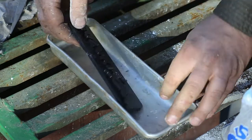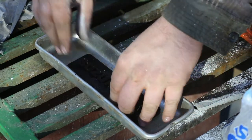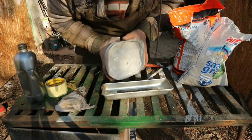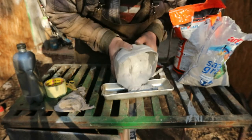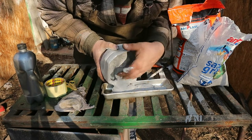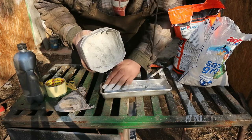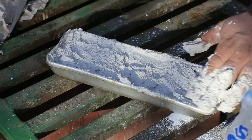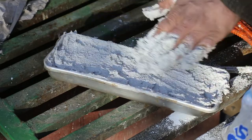Afterwards I'm going to remove the two of them from the metal tray and heat them up to about 200 degrees Celsius. This will melt the PLA plastic and hopefully leave me a cavity that will serve as a mold to pour the melted aluminum in. So as you can see I've started pouring the plaster of Paris mixture. You have to work very fast because this mixture hardens very quickly.